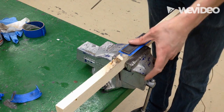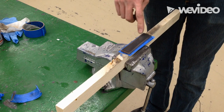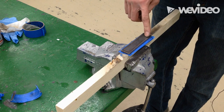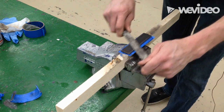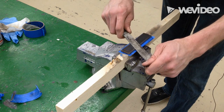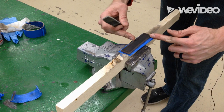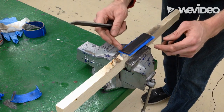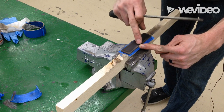Okay, I decided to bring you back in. If you look at this one, you'll see how I have the silver around all the outsides. Last time, if you paid attention, I had a dark spot here and a dark spot here that wouldn't go away — the middle was silver. What was happening is I was filing back and forth in small motions. For every time I came back once, I went forward twice. So if you do it at one end and go back, you end up with two times at the back, two times at the front, and actually four times in the middle — that's how I got rid of the metal in the middle first.